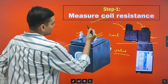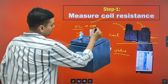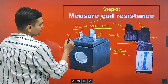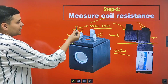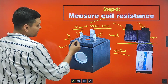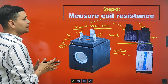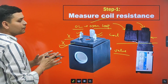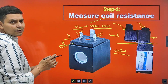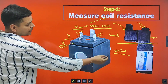We will check the coil resistance. If it reads OL (open loop), then the coil wiring is open and it is not working. Sometimes it can be a short circuit, in which case it is also not working. If the coil resistance comes in finite ohms — such as 200 ohms, 300 ohms, or 500 ohms — then the coil is working okay.